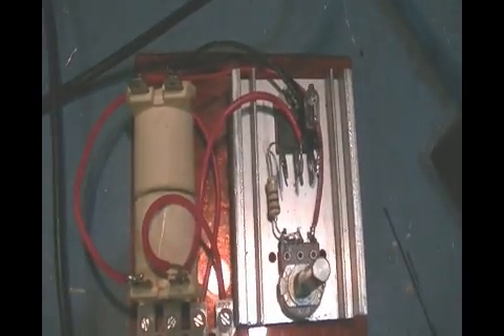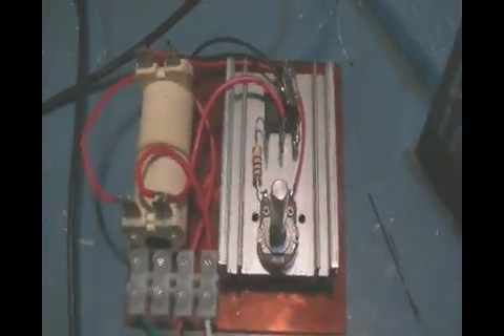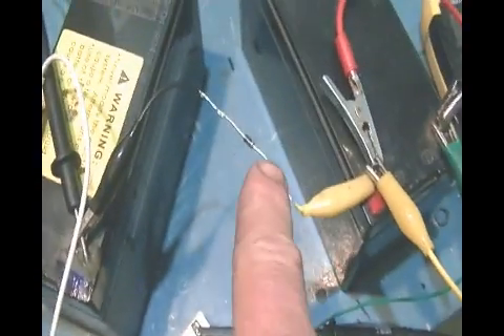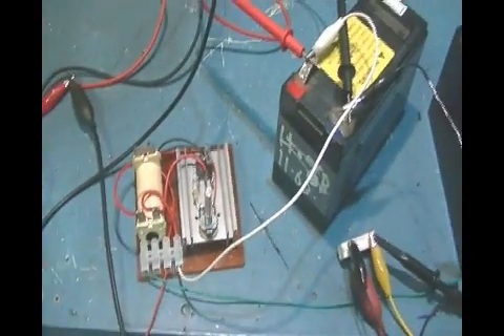I built another little something today — very simple. It is the basic SSG circuit without the diode on the collector like we would normally put it. Leave that off, the rest is the same, and simply put a diode between the run and the charge battery in that direction. Cheers from the tin shed.